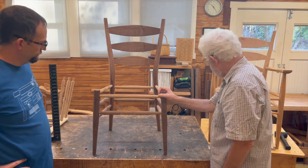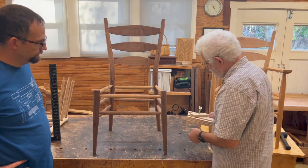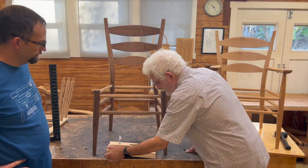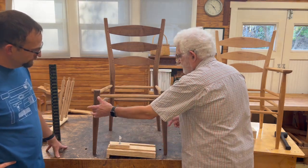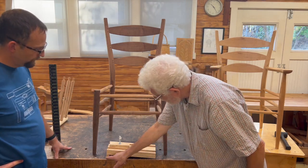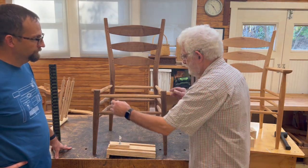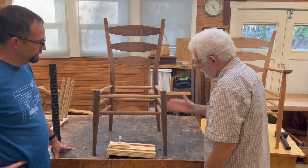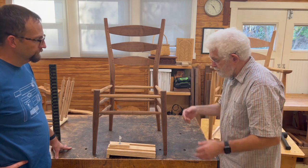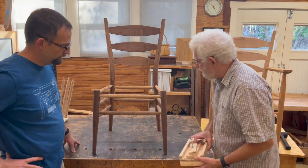When we drill for the front rungs into the front legs, we use a similar jig, but the riser block for the splay is not as tall — there's not as much splay in the front as there is in the rear. All we do is swap out the riser block for something shorter to drill these front rungs, because they're not vertical up and down. We can't do it flat and stable like we did in the two assemblies we just talked about. And that's really the only variation.